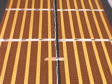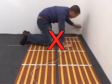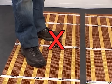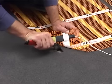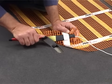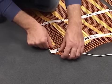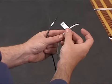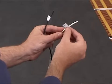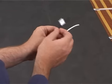Place the cold leads between the mats, ensuring they do not cross over them. If possible, avoid standing on the mats. Create a slight groove in the insulation material to accommodate the slightly thicker lead connector and to help the mat lie flat. Mark each pair of leads with an identically numbered sticker. The sticker should be near the end of the lead so it can be easily seen.